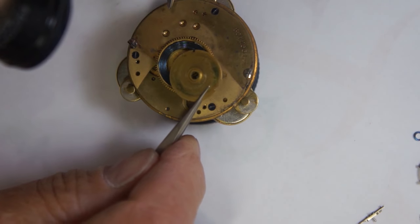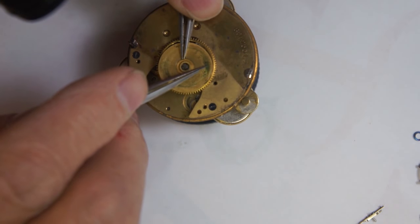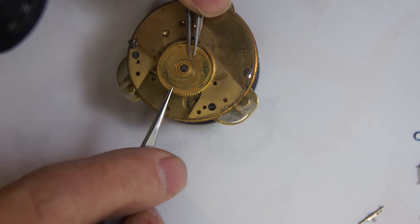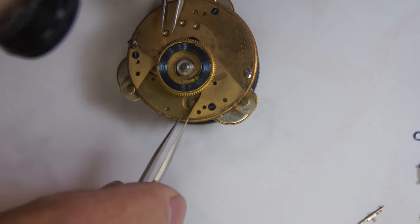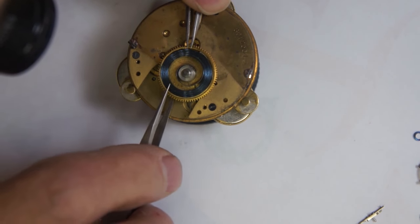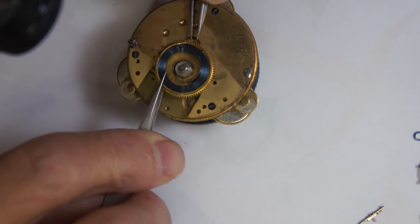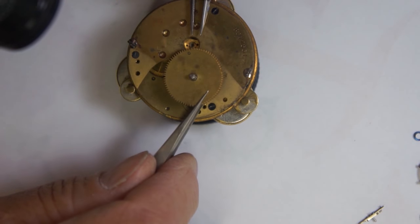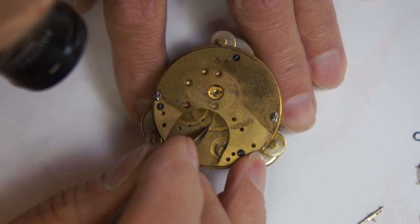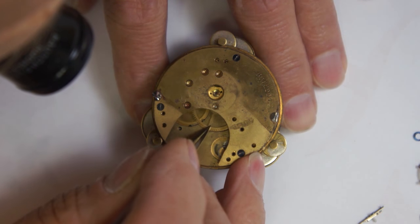It has some oil residue right here. That's the green color that has turned to grease due to age. The mainspring isn't broke, but will need to be removed to inspect further. It's one of the old blue steel springs. All the new ones are made from a stainless type of steel and are considered to be unbreakable. The gears seem to rotate fairly smoothly. Doesn't appear to be any damaged teeth.